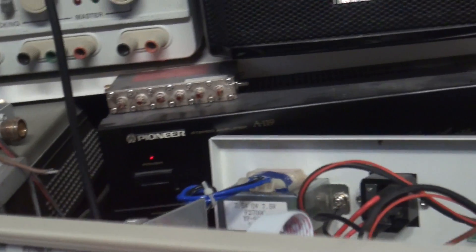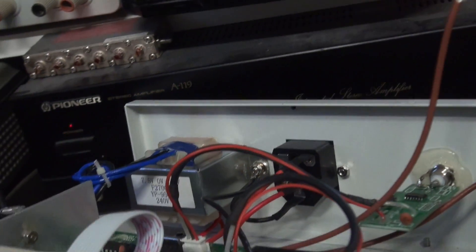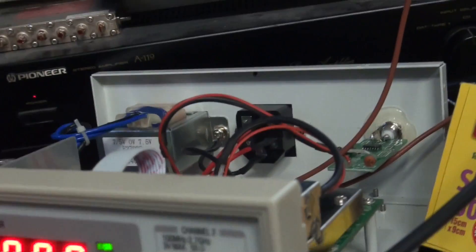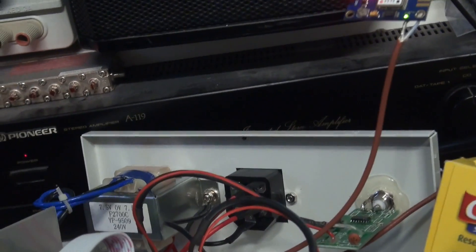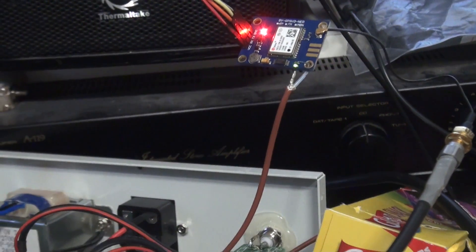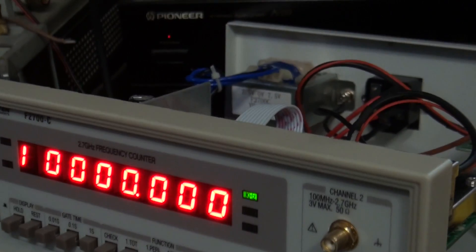So if you build it in place of the original oscillator — if you build the actual GPS board into the counter in place of the regular oscillator, and just have an SMA antenna socket on the back for your GPS antenna — you could just leave it permanently on when you need to use it. You might have to wait a few minutes when first powered up after a long period of not using it, while the GPS gets its satellites and locks on. But that's not really a big deal. The good thing is that until it's actually locked, your counter won't even work at all — so you know that it's not locked.